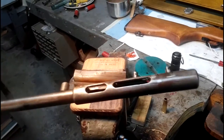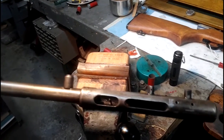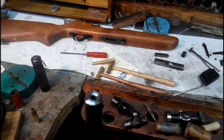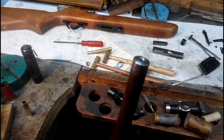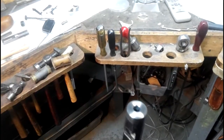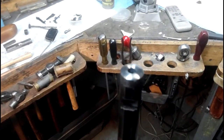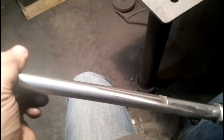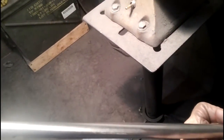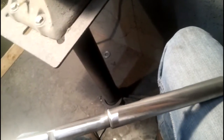The first thing I like to do after I take a gun apart is re-crown the barrel. You have to put it in a lathe, and if you get the outside all polished up, you don't want to mar it up with the chuck that's in the lathe. There's our crown — crown's finished, looks really good. Done started polishing on it. What I'm doing right now is going over this with a fine tooth comb, taking a little bit of time, because I want to make sure we get all the pits out and make sure things are blended in with no dips.